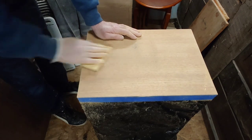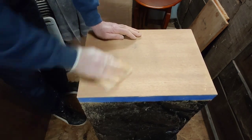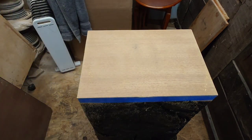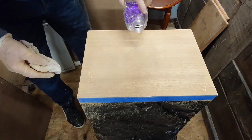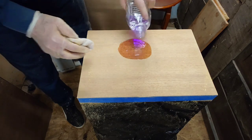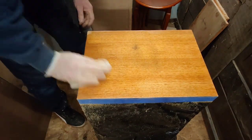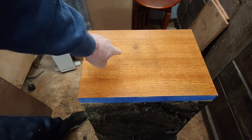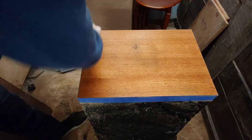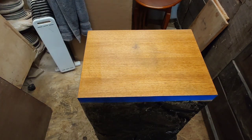This is where that ring mark was just here. You can only go so far with veneer, so I think that's done. Now we need to neutralize the surface with some methylated spirits. Once we wet the surface we'll be able to see if there are any marks still in it. There we go — that's pretty good, not bad. There's a mark here where the veneer's gone very thin, so I'll be drawing some false grain over that. We'll leave that to dry and then come back and add a coat of polish.